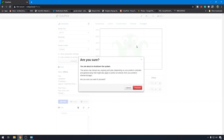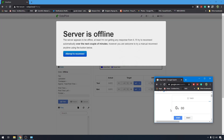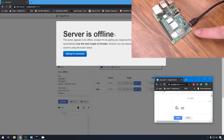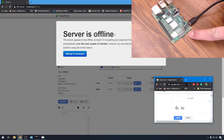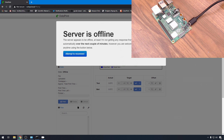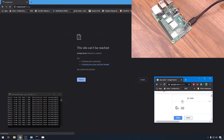We can just come up here and hit shut down system, and we'll hit proceed. We'll bring up our Google stopwatch and bring up command line - I'm going to ping the network interface to see how fast it's available. So let's do ping 192.168.1.17 with a dash T next to it so it continually pings. You can see the requests are timing out because it's not available. We have a Raspberry Pi up in the corner - the Power LED and the Activity LED will blink when we power it up. I'm also going to use the Easy Refresh plugin for Chrome refreshing every second. We've got our stopwatch going and we're pinging our network interface. Let's go ahead and turn the power on.